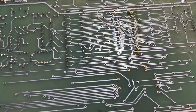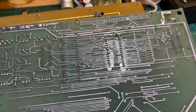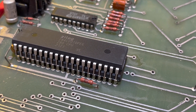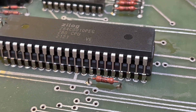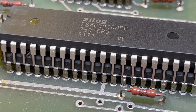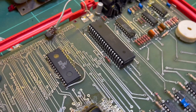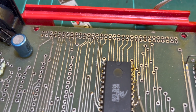An interesting thing to know is that they use 2.5 millimeter pin spacing, not 2.54 millimeter which is based on imperial units. I've overlaid the UB880 with a genuine Z80 and you can see the pins initially line up but then slowly get out of sync. Apparently they did make an export version with 2.54 millimeter spacing. The same applies to the expansion port — you can't just stick a 2.54mm header on there.